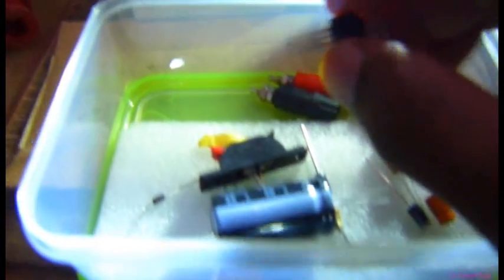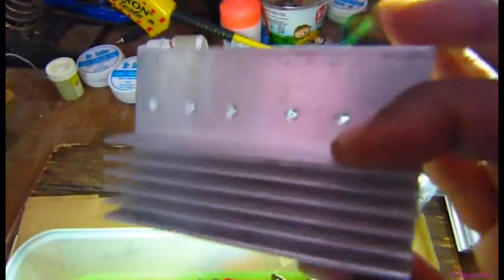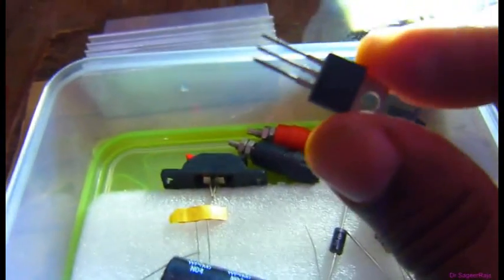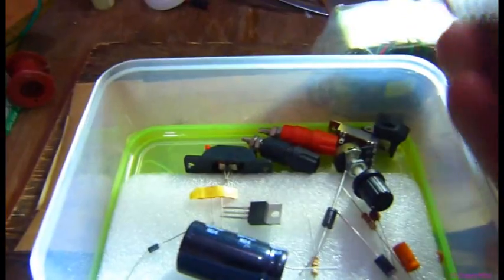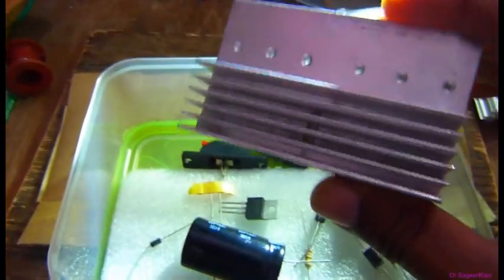If you use this voltage regulator IC, the LM350, you need a very good heat sink, because during this process it dissipates a lot of heat energy. The LM350 has an internal mechanism of limiting the current and thermal shutdown. So to get an unfluctuated, continuous power supply current, you need a very good heat sink — don't forget that.